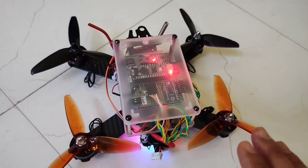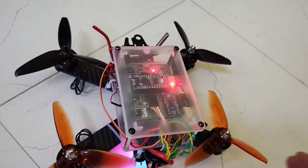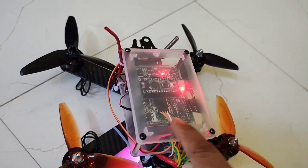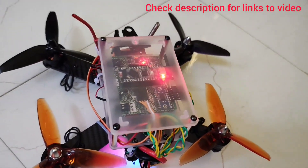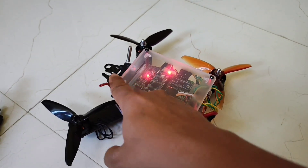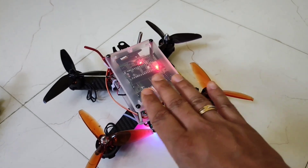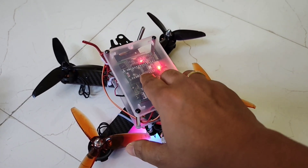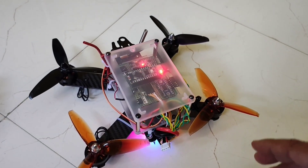Once I had the ESP32 drone, I wanted the ESP32 controller for added capabilities. Previously with Arduino I had limitations on calculation speed and refresh rate. In my last Arduino drone video — linked in the description — I achieved 400 Hz refresh rate, but I had to add multiple Arduino controllers, separating motor control and primary flight controller calculations into different Arduinos. That was not a practical approach. Now on this build, the refresh rate is 2 milliseconds, so I'm running at 500 Hz, which is very high, and I still have plenty of microseconds left for additional calculations.